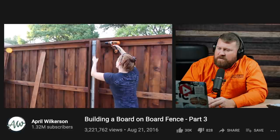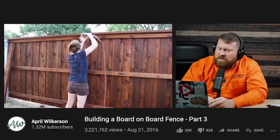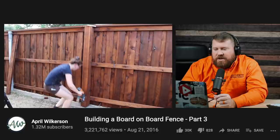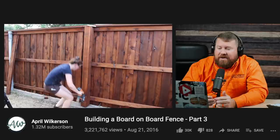After finishing one side, she repeated the process for the other. To finish the box off, she came back with a third picket, used something flat — a speed square — to make sure it was in line with the two side pickets, then used a little construction adhesive and a brad nailer to attach it permanently. When you're dealing with a really thin surface, with pickets affixed perpendicularly giving only a small nailing surface, the wood adhesive adds another layer of bonding between the pickets. Great idea.